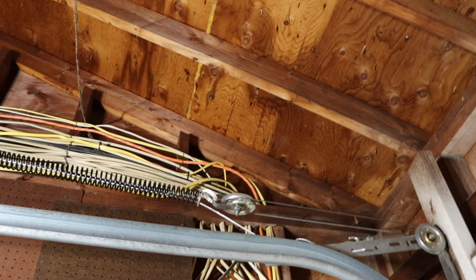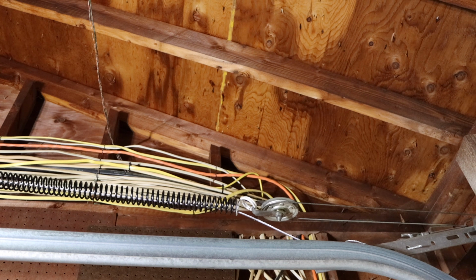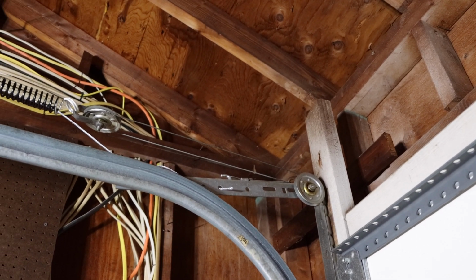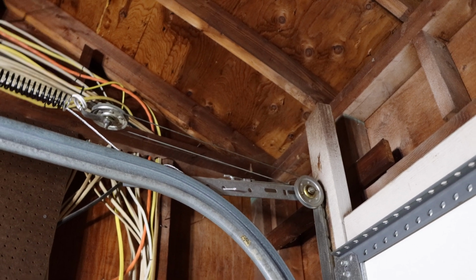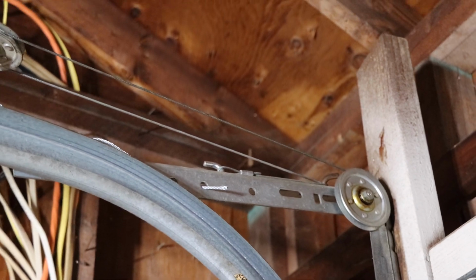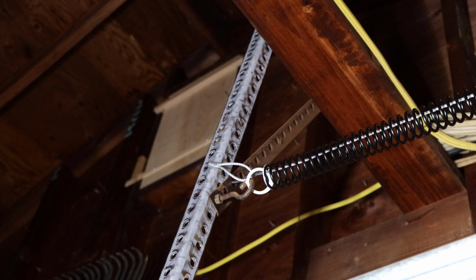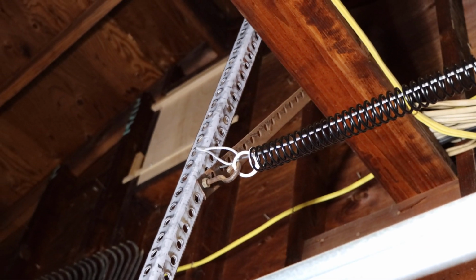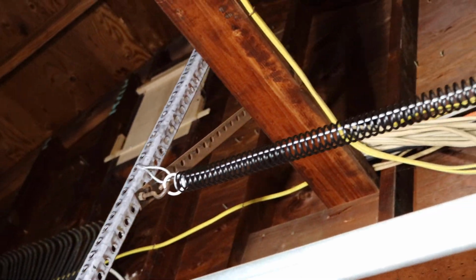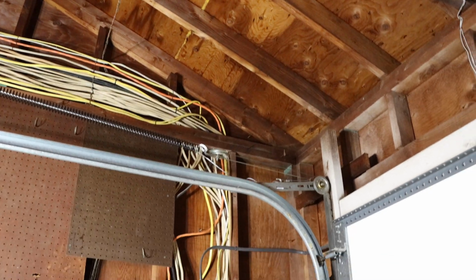You can see right there, we have our pulley connected on, the bolt is tight, the spring is wrapped right through the end of the pulley. It's around on that other gear right up there. Our cables are connected onto the pulleys, just the S-hooks, just the way it's supposed to be. Hope you can see that okay. All right, we took this across here. We connected it up right to that eyelet that we put on there. Nice and tight. We have our safety cable on there. And that's it. And that's all there is to it.